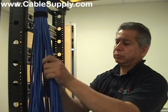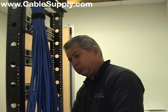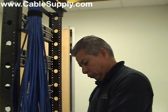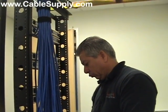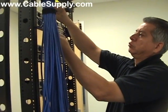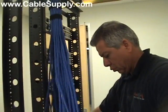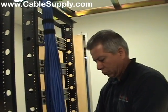In reality, if you cable as cables flow and then identify where each is at on the patch panel, it's half the labor. You're not tracing one cable at a time, which is time-consuming. You just go to the jack, look at the number, go to the patch panel, and know exactly where it's at — or number them on the floor plan so people know a jack in a given room is associated with port 22 on patch panel A. It's pretty straightforward.